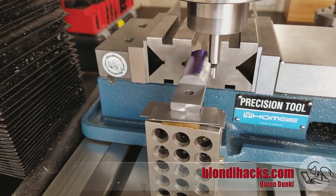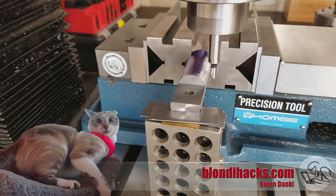Now we're setting up to make that big slot all the way through, and I want to talk about this setup because it's definitely not ideal. When I initially set this up, I felt there wasn't enough room between those V-blocks to do the milling between them in the vise, so I used them to hold the end of the part and then supported the far end with a flat on a 1-2-3 block and some shims. I could have used a machinist jack instead — I don't actually have any, so this was incentive to go make some. The takeaway is that while this setup wasn't ideal, it did actually work just fine, and there are lots of ways to do any machining operation. When I did the second hinge, I just milled the slot in between the V-blocks and that was a lot easier. There are lots of ways to skin a cat in machining.